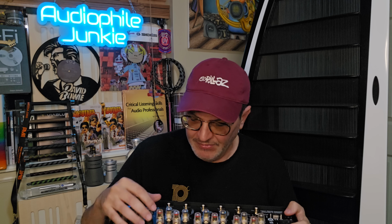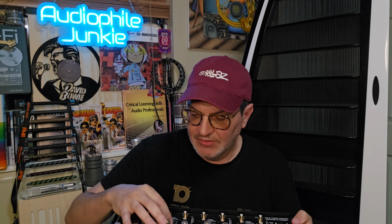Well, you don't want to use DSP to have to use some of its range just to correct for level. So for any difference in your speaker sensitivity, where one is louder than the other, you can, like in this case, choose the 6 dB bridge tab and increase the gain of your center channel, and then it hopefully will mate better with your mains. Very powerful to be able to change the gain somewhat with these tabs and make all your channels level without having to do DSP.